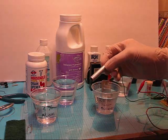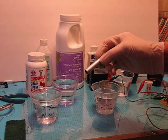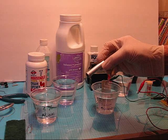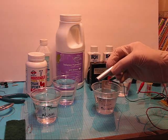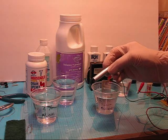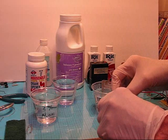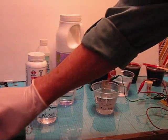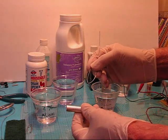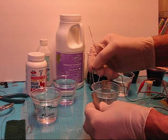Aluminum actually already has a coating of oxide on it. As soon as it's forged or manipulated in any way, it forms aluminum oxide as soon as it hits the air. The purpose of anodizing is to add a little more hardness, but in most cases it's to make it more decorative — so you can dye it, change the colors, and have some fun with it. One thing to consider is how you connect the parts so that nothing other than aluminum is inside the etching solution — that's true for all anodizing.